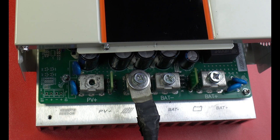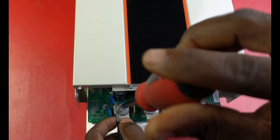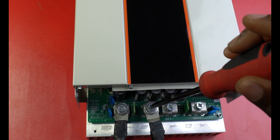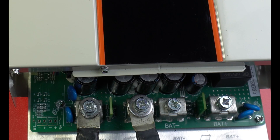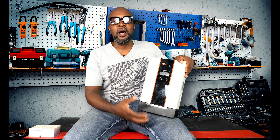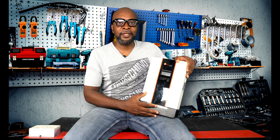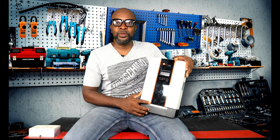One of my biggest frustrations on location is discovering that the charge controller was meant for a cable diameter of around 16mm or 25mm, but you have something bigger — it becomes a struggle to squeeze it into that square box screw hole. But this gives you the option of using a cable lock, and the beauty is there's really no limit to the diameter cable you use. It could be 10mm, 16mm, 25mm — whatever. Just get the cable lock for that diameter, clip it in and insert it. It makes your job a whole lot easier and the installation very, very simple. Most charge controllers don't have that cable lock option, so this is really beautiful.